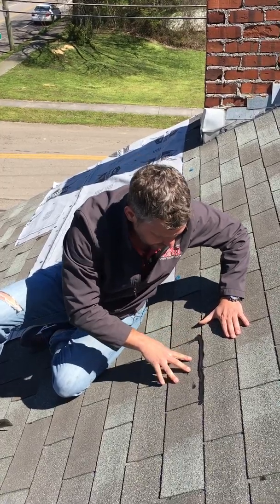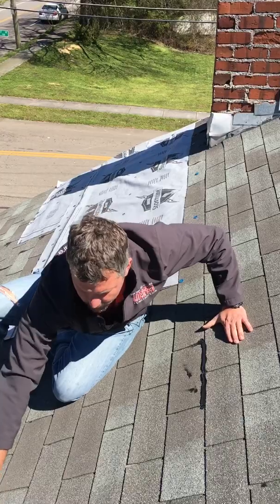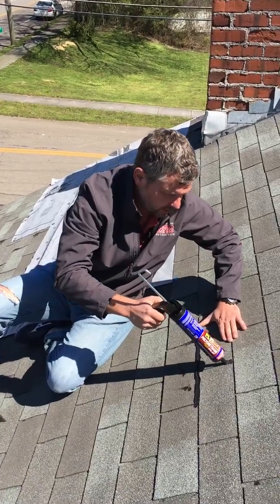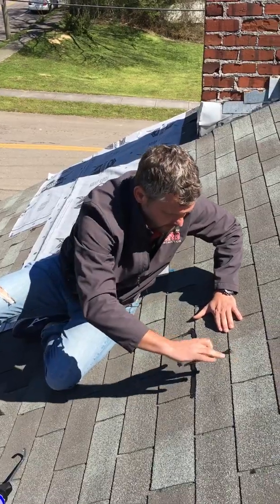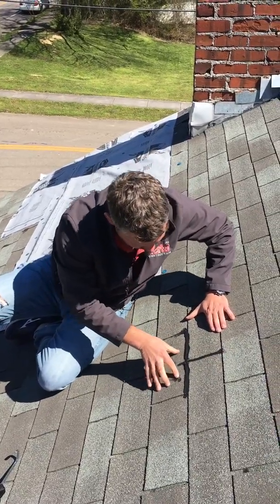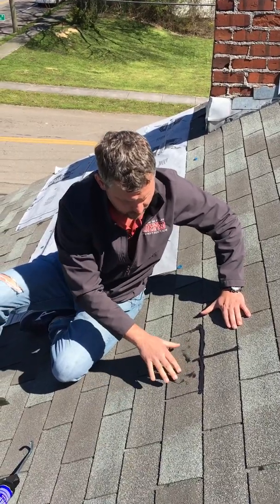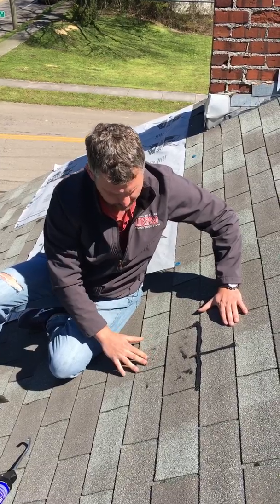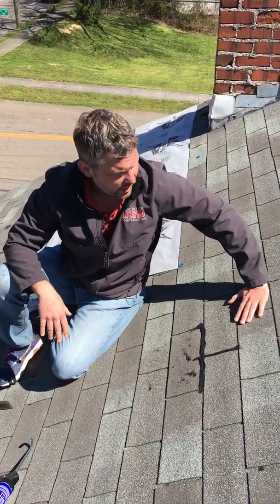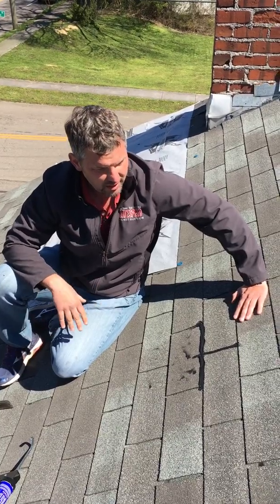This way the owner won't have any chance of roof leaks, and this fractured shingle can stay in place. You might even want to hit the union up above so there's no chance that shingle can have water get in there. This is a great temporary repair — there's really no manufacturer that's going to say this is an acceptable long-term repair, which is a little bit more evidence to discuss.